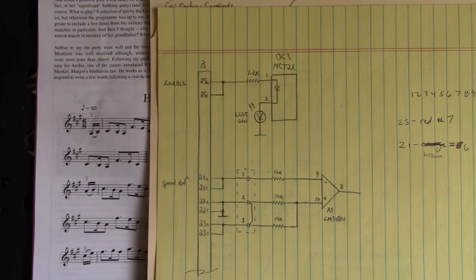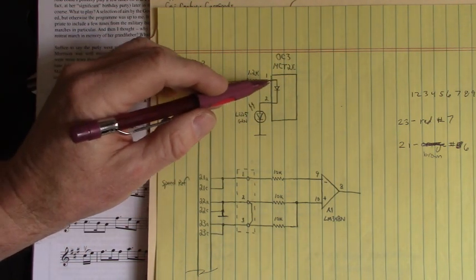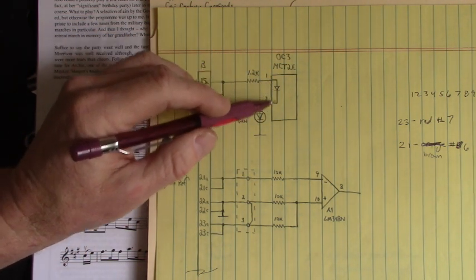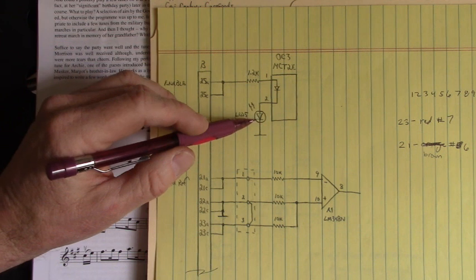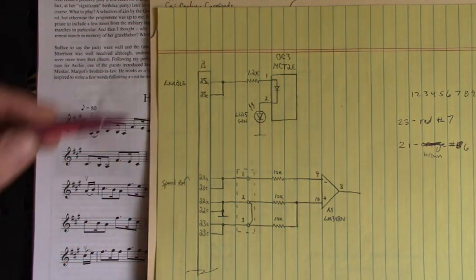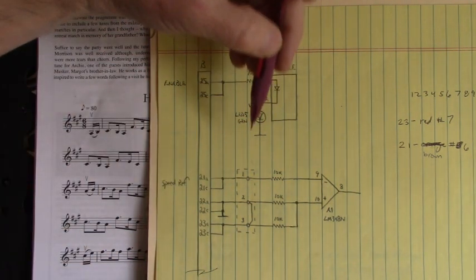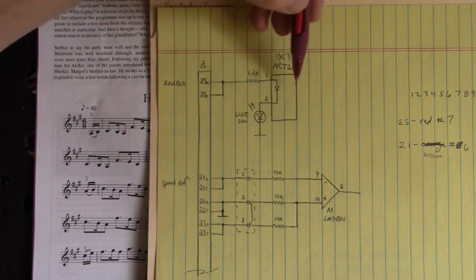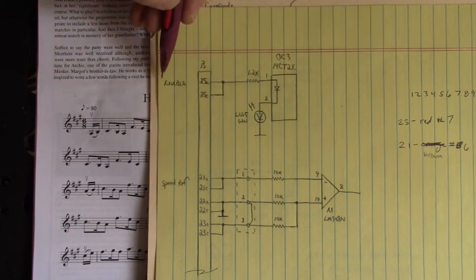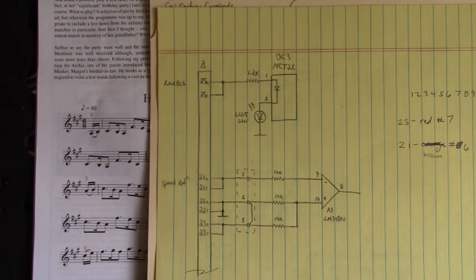Here, this is a nice thing about this drive, there's an LED in the cathode circuit, so your current flows through the resistor, through the LED inside the optocoupler, through the anode cathode junction right here, back to ground, back to that 12 volt ground. And that LED turned on, indicating that you were enabled. So if I saw that green LED on, I knew we were running. Again, not worried about where this goes, just that if I enabled that input and that motor ran, I knew that was the enable. Cool.